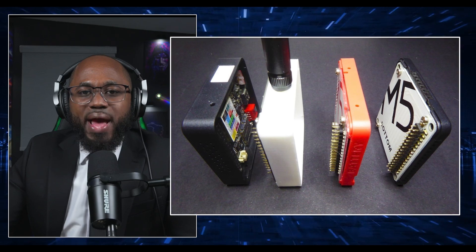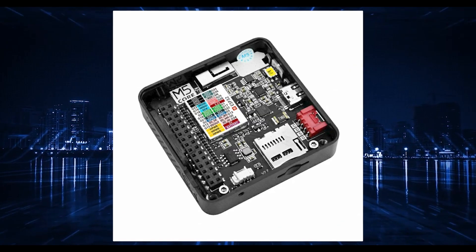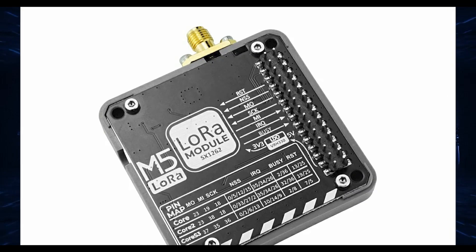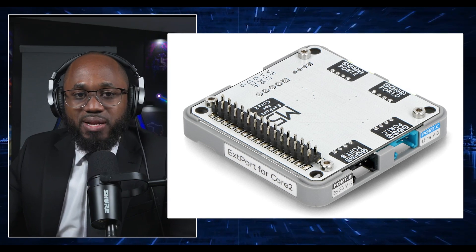The fourth build is the M5Stack Core2 and the LoRa 868 module version 1.2, which is highly feasible and well-supported by open-source projects like MeshTastic. The core components are the M5Stack Core2 — an ESP32-based modular controller with touchscreen and battery — and the LoRa 868 version 1.2 module featuring the E22-900M22S or SX1262 chip, operating in the 868 MHz ISM band. It supports up to 4 km range, 22 dBm transmit power, and -147 dBm receive sensitivity. It uses an SPI interface with DIP switches for flexible pin assignment.